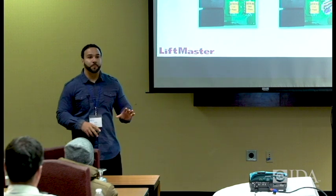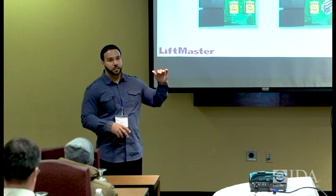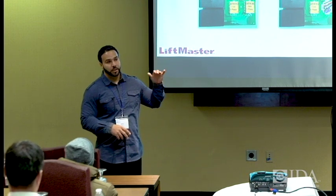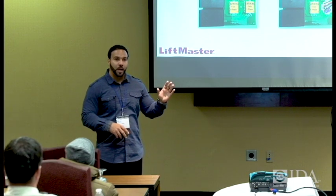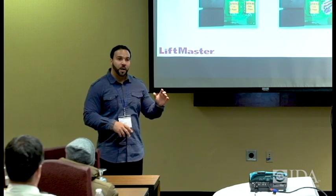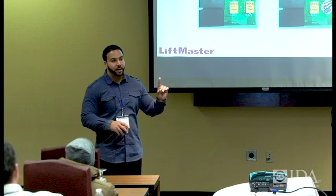You can lose all kinds of components in this unit because it's not truly rated for that. When your voltage after startup and load is still at 208, you're pretty safe, because 208 is within the tolerance of the 230. But when you drop below that, you're not safe anymore. So it's truly not rated for 208.